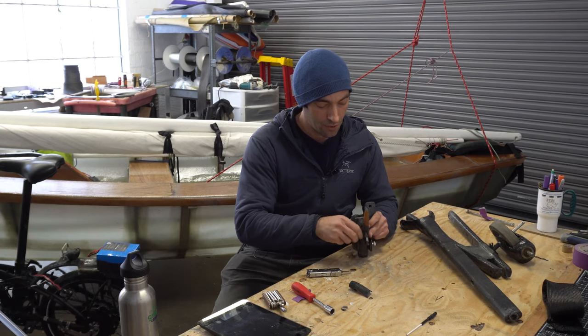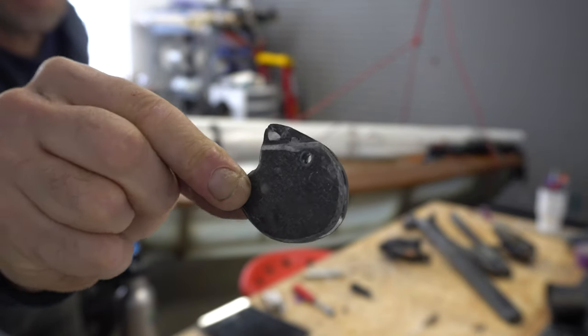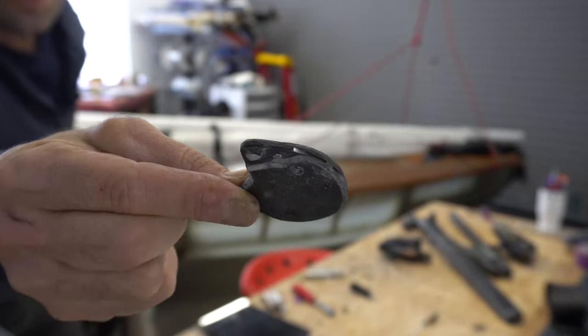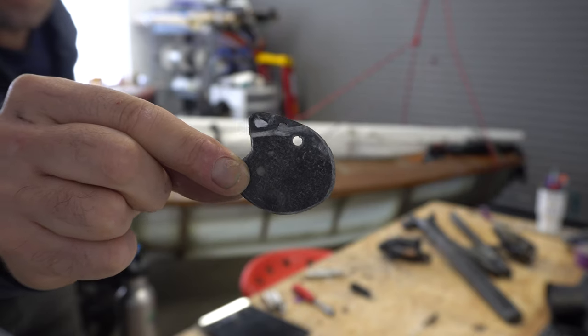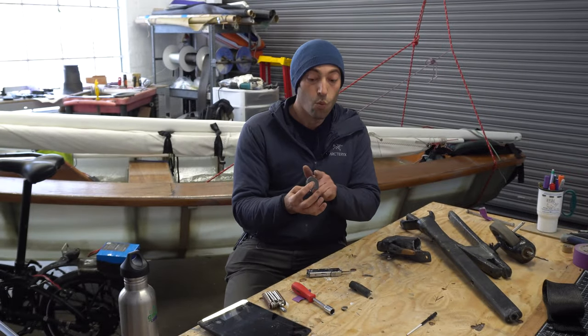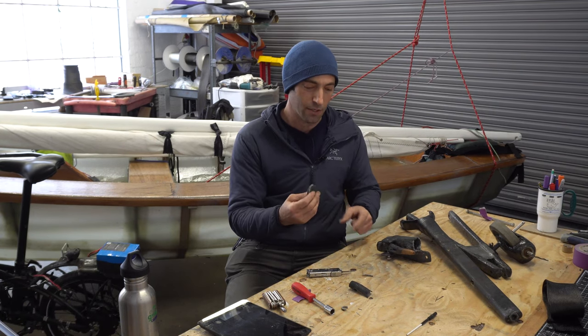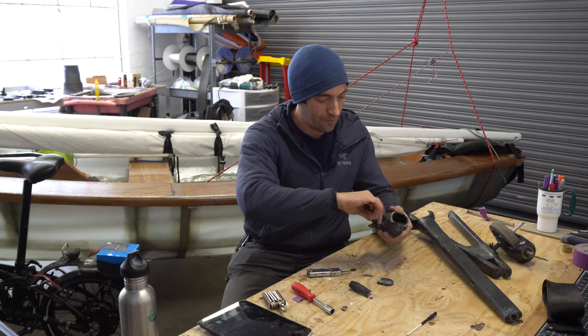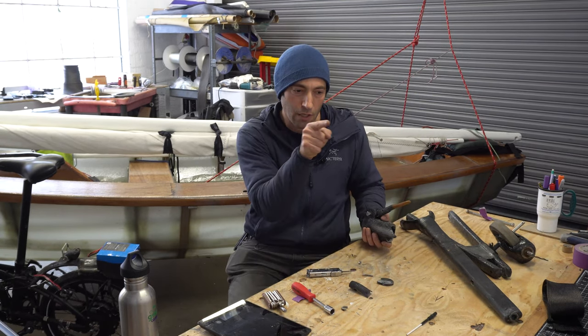So this swinger mechanism, there's the aluminum, it's got some carbon, it's got some glass. I switched to glass so that I could shine a light through it and see where to re-drill the hole there. So this swinging mechanism is now wider. It was strong enough, but I needed to make it thicker so that when it hit the surface here, the force wasn't as focused on a little knife edge.